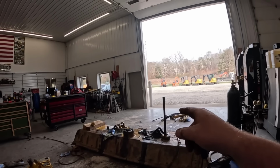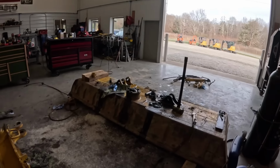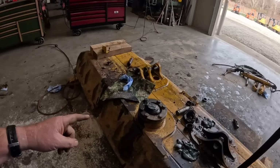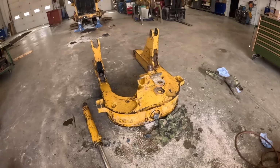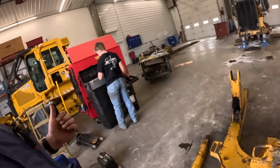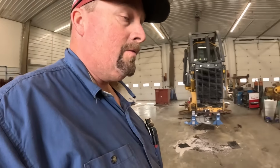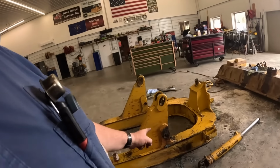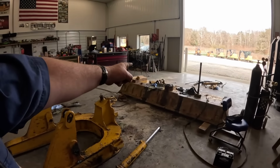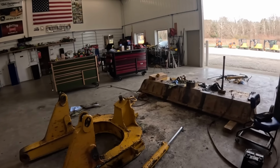We'll be back. I've got a new ball and socket ordered. It's probably gonna get out his air arc, gouge these welds off, get these busted off, everything cleaned up, and start line boring and reassembly. We'll get our new Malco Tools line boring machine out. I don't know how many holes we'll have to do. We got a couple. I know that one's bad. That long one's bad over there. So while we got it apart, we might as well do it.